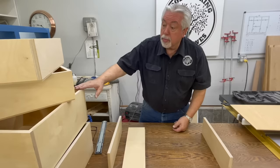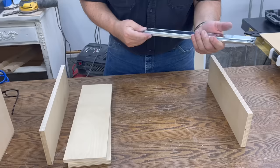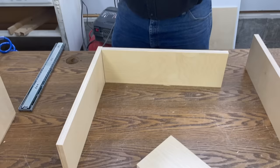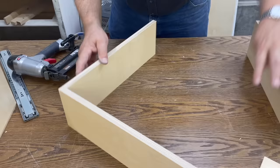Now with our painting all done, before we do our final assembly we have one more thing to do — we have to put together our drawers. We're going to be using 5/8-inch pre-finished Baltic birch and we're building them for a half-inch thick side full-extension ball bearing guide with a soft close mechanism. We've done a couple of videos on drawer building and I'll provide a link to those. It's just a very simple drawer with a butt joint — no glue, just nails.